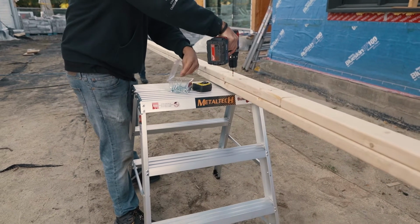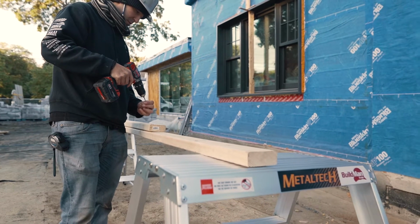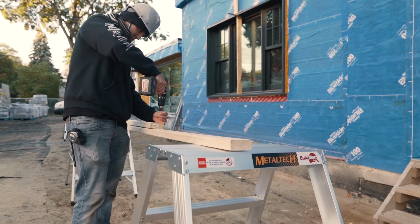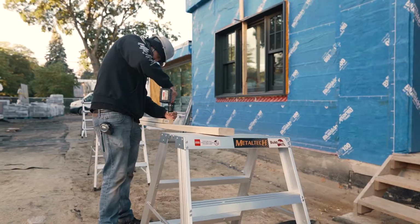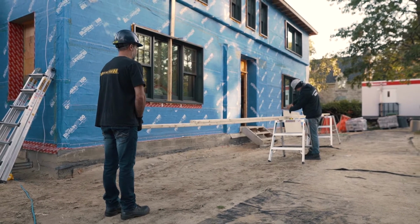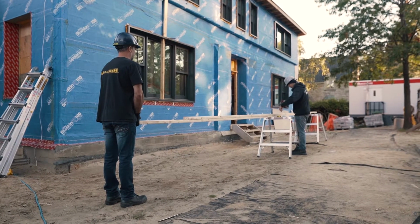To reach a maximum height, up to 30 feet, your 2x4s may be spliced. The 2x4s must overlap a minimum of 3 feet, and screws should be a minimum of 6 inches center to center on each side of the splice. We recommend using mending plates on all splices for maximum strength. When using 10-penny nails, always countersink all nails.